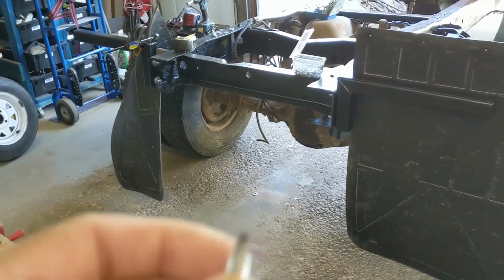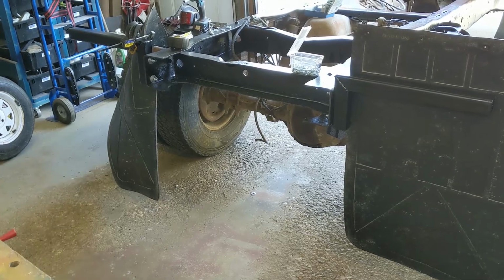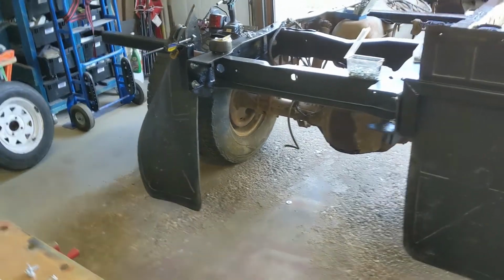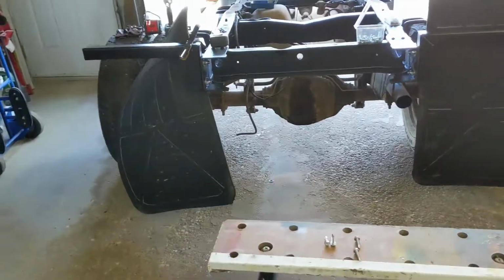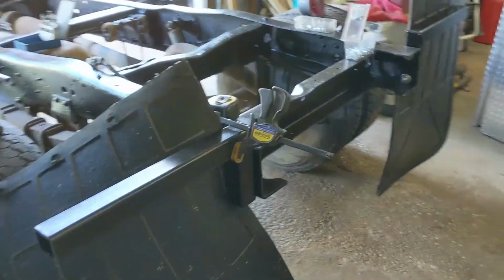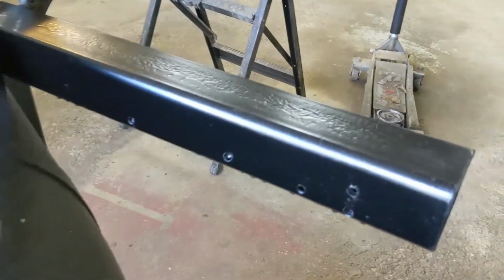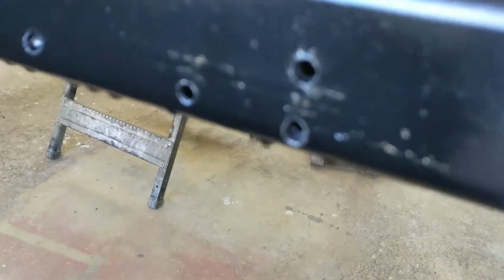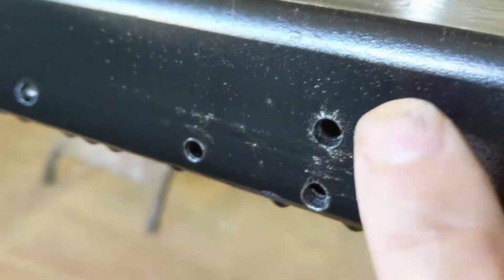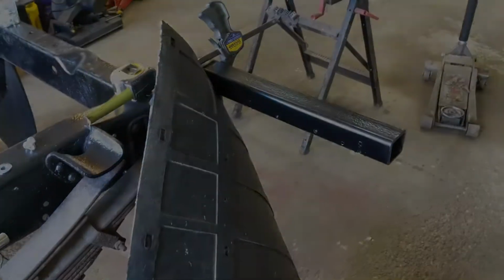So yeah, welded tube, avoid it with self-tappers. Even drill bits. Man, I tried to drill them out with a drill bit. Now, I could have used the cobalts on it, but I figured it's easier just to raise the flap above the seam area. You can see there's where the welded seam is, so if I bring it up here, it'll be fine. Oh, there we go, back into focus again.